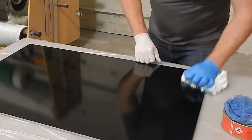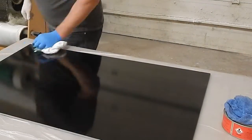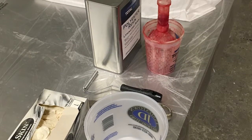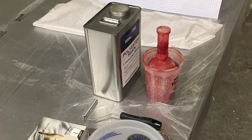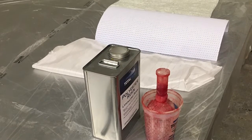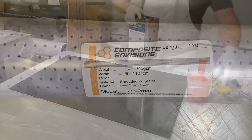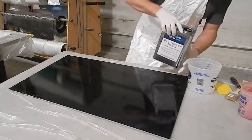I'll do this three times — I'm just showing one coat here before I lay up. Here's the material: it's general purpose polyester laminating resin with no wax, and this is the core mat. It's a two millimeter core mat, and I'm going to mix up the resin.